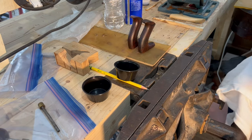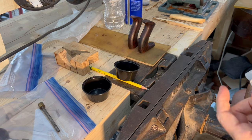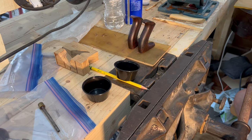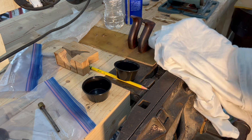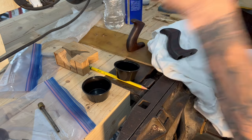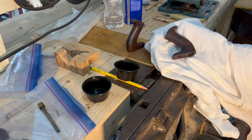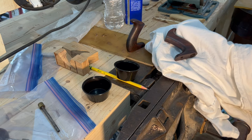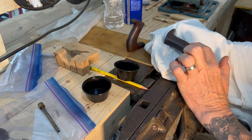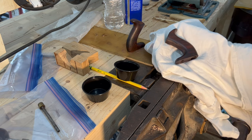Okay, we're at our next step. After our epoxy was dried and you saw me peel off my squeeze out as it was semi-cured, I love that new process because it lifted just part of the original finish. And we're doing two totes at the same time. These are both for the same person. We're featuring one and I'm doing the other one kind of on the side. So I'll share both of those with you. But where are we? I used nitrocellulose lacquer and I brushed it in and kind of let it flow and filled in where my finish had been removed.